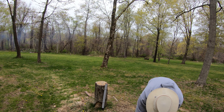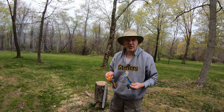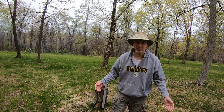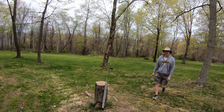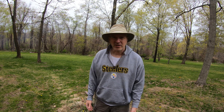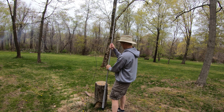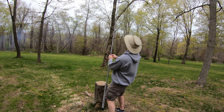I'm going to use my dipole. I'm going to set it up for 40 meters first and then try to add some sections to make it 80. I thought I had them pre-made but turns out I used them for something else as usual. For 40-meter NVIS you really don't want to be that high — I think it's 15 to 20 feet something like that — so I'm not going to use the full height. Actually, I think I'm going to keep it right there.